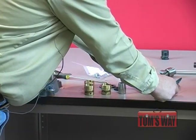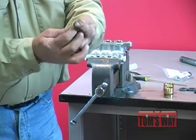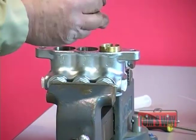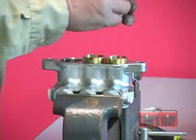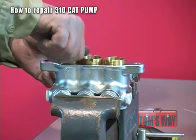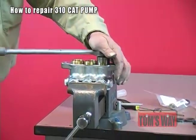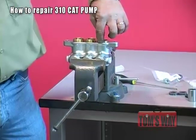They come in a little separate bag — there are three of them. That's the only three large O-rings in the set. Put them on, squeeze them down, put them in the groove back inside the pump. Take your tool, put them on, and just snug them down. You don't have to kill these things — you just snug them down. The easiest way to tell whether they're in place is if you look at the grooves in the seal case — they'll sit flush with the head.